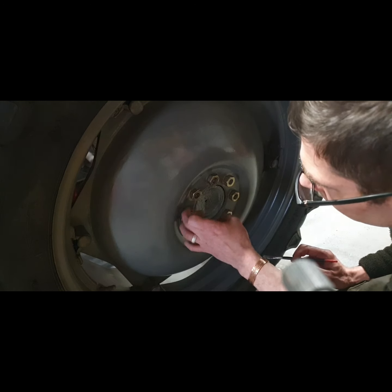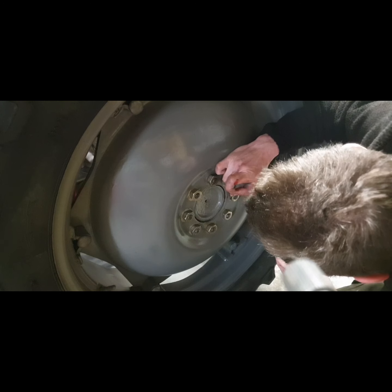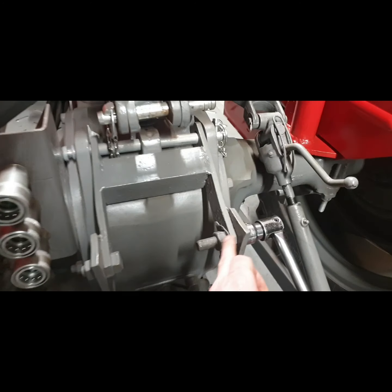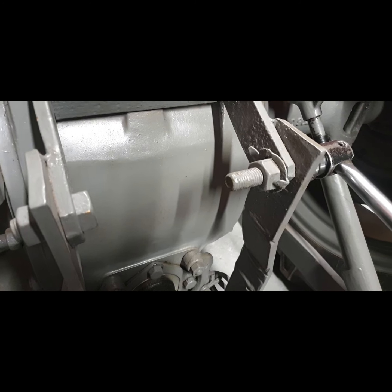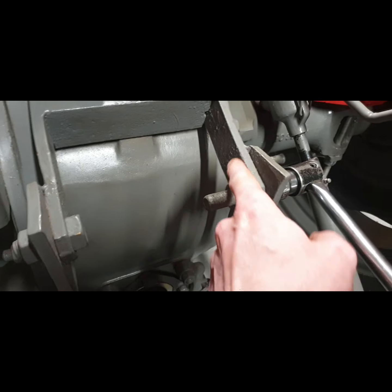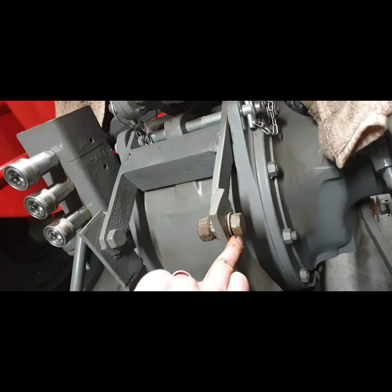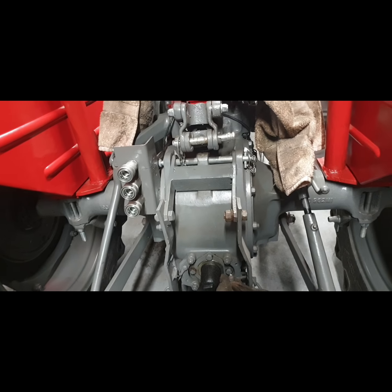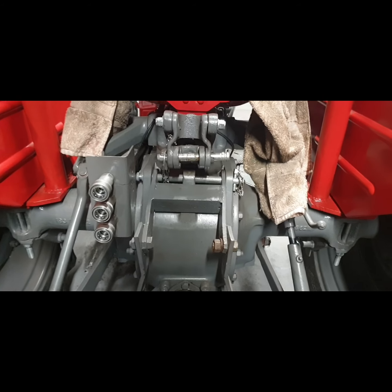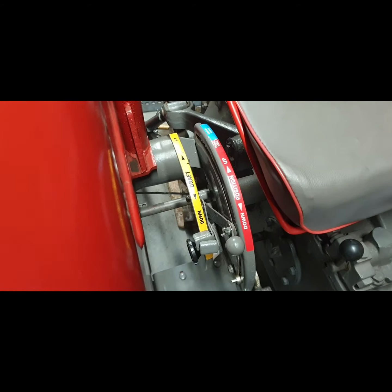Some of the paint here is a little bit damaged from what looks like impact guns or something. I'll use a smaller detail brush and just touch that up. I'm going to take this bolt off — this washer here is actually for a belt pulley on the crankshaft, for a starting handle dog. I'm going to put a proper washer on there, cut it to length to get it looking tidier: a nice stainless steel washer, cut to length, a nice spring washer, and just the right amount of thread sticking out. I'll also show a little clip of these decals fitted — they're a nice little touch.